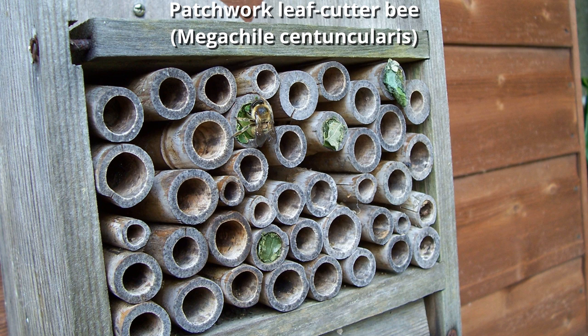To make the most of this habitat, we're going to drill a range of holes into bits of wood. You've probably been to your local supermarket or garden centre and seen bee hotels for about a fiver — and realistically they're not that good long-term for bees. A lot of them are quite shallow; the tubes are often from canes. All the holes I'm going to be drilling are going to be a minimum of five to six inches — 125 to 150 millimetres deep.